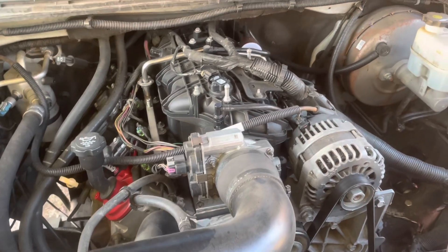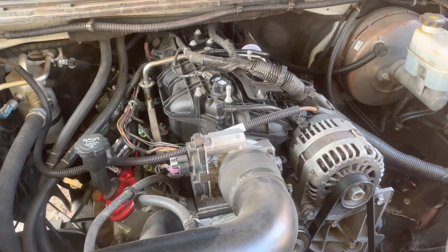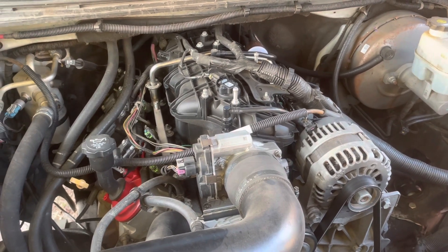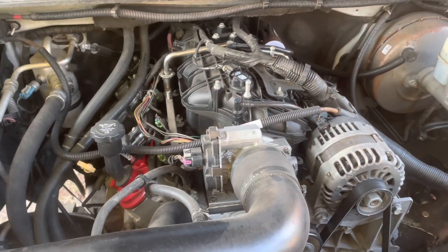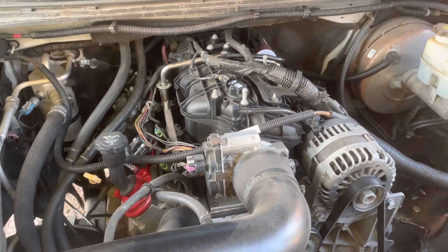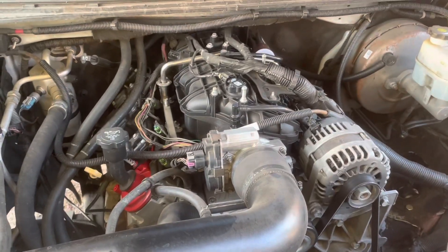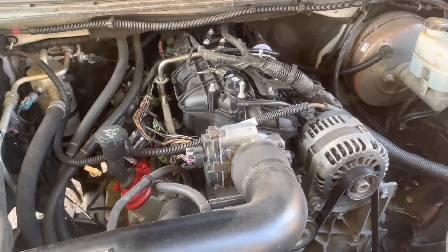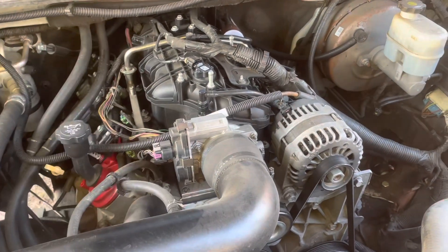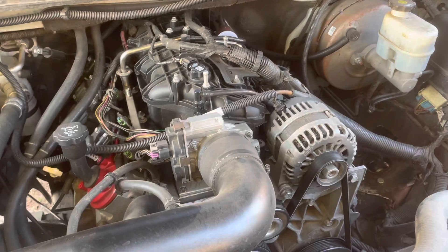There is a premium to do this. You need a new exhaust system, which is about $1,000. You need a new LS flywheel, which is about $400. And then you'll need what's called a heat exchanger — you put a raw water pump on the front of this engine that pumps raw water through a heat exchanger, and the engine's coolant circulates through the other side so the water in this engine never touches the salt water or any other raw water.